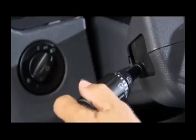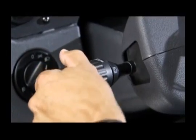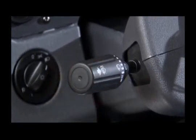Cascadia's new wiper, high beam headlights, and flash controls are integrated into the turn signal. Wiper on-off and delay is determined by rotating the outer section of the control handle counterclockwise toward the windshield. Each detent, marked by lines of increasing length, increases the frequency of wiper action. Push the entire handle in toward the column to activate the wiper fluid spray.